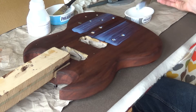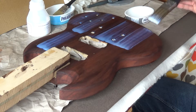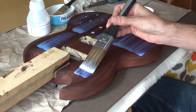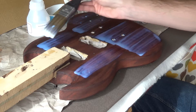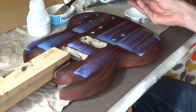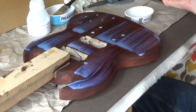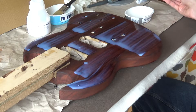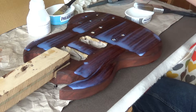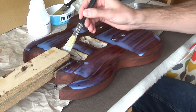I don't know whether those... that's too much. I just need to go for it. I'm pulling off some stain - some stain is coming off. I'm trying not to overlap, just lay it on reasonably thick and not butt up against it. I should have gone across the whole thing. I can see it lifting in places. I'm just going to try and get as much coverage as I can and drip it as little as possible - he says, dripping it - and try not to overlap and just leave it as it is. That might even be enough.